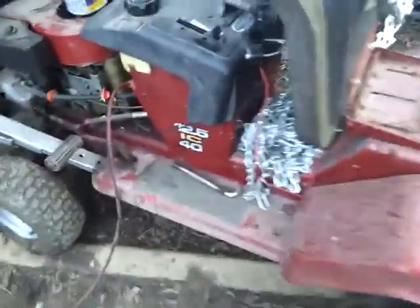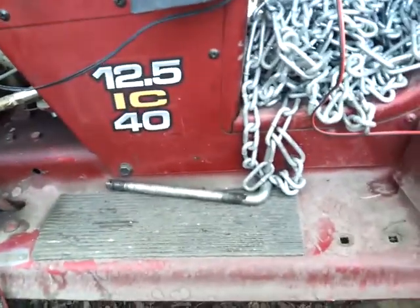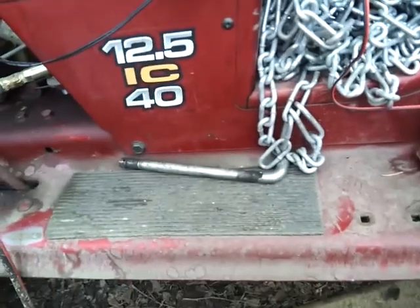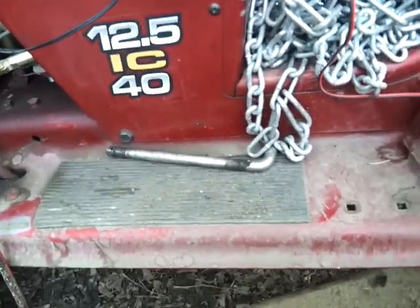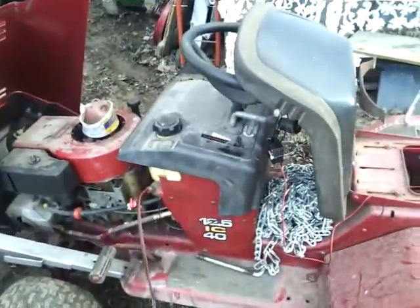But one thing I do like about this is it's a two-piece frame. See, this can come off to access everything underneath, access the linkage, and then it's the pan. The pan holds everything together. I call these unibody style tractors. The Kubota, that's another thing that's going for it, is a full frame tractor. So they both have their pros, they both have their cons.